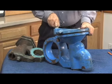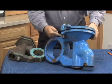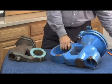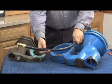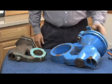Here's where it would sit off the top here, and that high pressure sensing line comes through the bottom of the cover, comes up through the top of the cover, and that's where my air bleed is here. That's also what puts the high pressure sensing line on the top of my relief valve stem. Remember we talked about the hose. It would be connected like this, going to that port on the body where we made sure that we don't have that plugged into the check body.